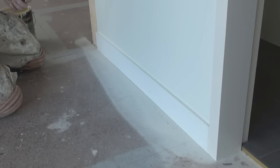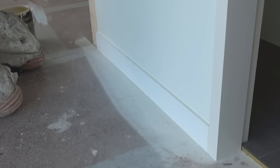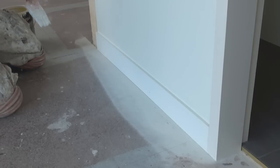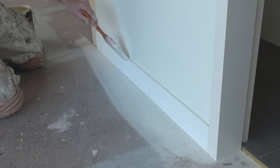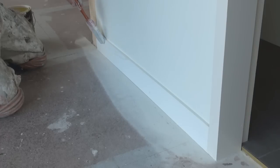Now I'm using a 63mm brush, or a 2 and a half inch brush. When it comes to painting the top edge, it's the basics of all cutting in. You just run the brush along there with a bit of paint on there.